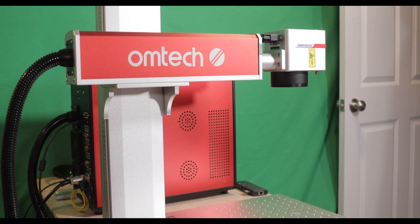Today I kind of just want to play with it and see what it can do. I went ahead and set it up just over there off-camera on its own little separate cart, mostly because the outlets I had weren't rated for it. That's something you should probably know if you get a higher-powered laser. Though it does work on 120 volts, the little built-in fuses there to protect the outlets popped every time. So I had to change that out and leave it on its own line. You can't have anything else running on it because it draws so much power it's going to trip your breaker.